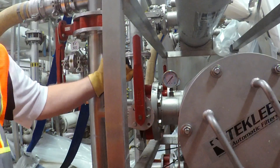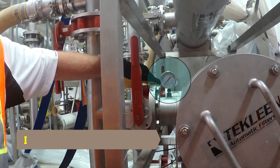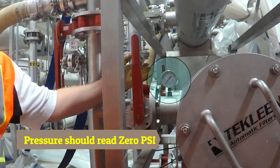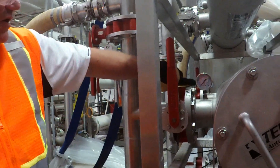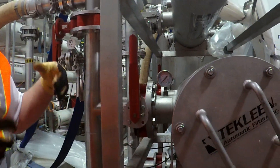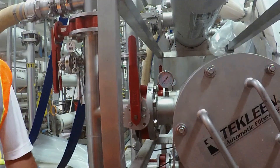So what we did is push the manual flush button on the filters. With the valves isolated, we watch the pressure go from 60 to zero. We want to make sure there's zero pressure so that when we open up the cover no one gets hurt. On the gauge you can see it's zero — both gauges are at zero — and it's valved out. Now we're ready to correctly open the filter up and perform a service on it.